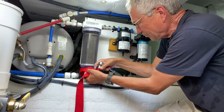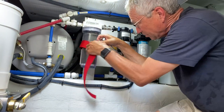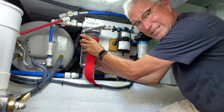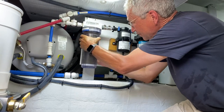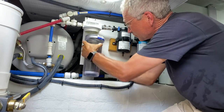After pushing the button to relieve pressure and turning off the water supply and the pump, I'll take my strap wrench. I have already pre-loosened this so it won't be this easy to take off normally, but you'll spin the water filter housing off. A little bit of water is going to come out — no big deal. That's what the bilge pump is for.